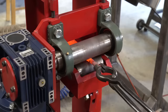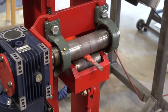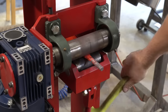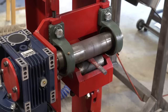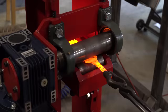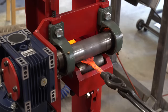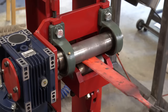There can be problems with rolling mills — here I've locked it up because there's a divot and the next part stopped it. When that happens you've got to turn it off, use a hammer, and reduce the lead screw so you can get the steel out again and restart. This is our final round on the mill; we should have it to the right thickness and gotten rid of most of those dimples, though you'll see later that a couple persist.